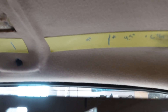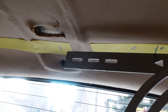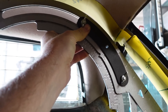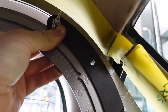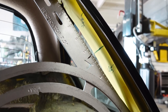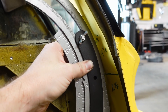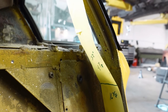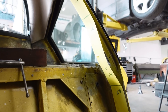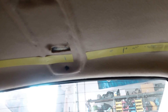Here you can see the marks that I made previously. My four and a half inch mark is nine inches away from the center of the car. I've made a mark where the bend ends at zero, then moved the bender down to the next bend where I've made a mark at my four and a half inch position and again where the bend ends. By using this protractor we can figure out exactly how long this tube needs to be. Let's put these measurements on paper.